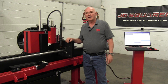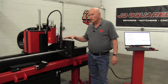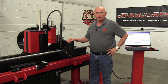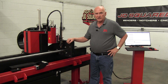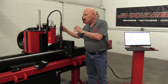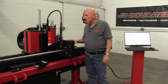Hi, Bob here with JD Squared. Hope you're having a great day. In this video we're going to talk about the tube stabilizer mechanism on the rotary cutter lineup — that's this system right here. It is designed to be installed and removed off the machine very quickly with quick-disconnect hoses and electrical lines, and there are only two bolts that hold it on, so every time you reinstall it you don't have to worry about any alignment — it just goes on.